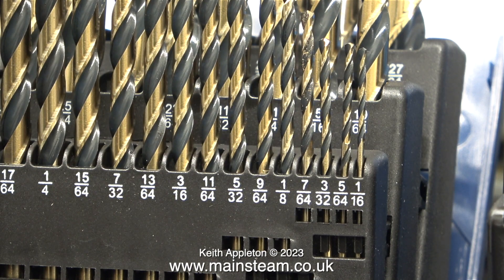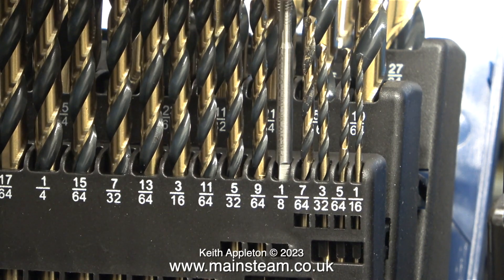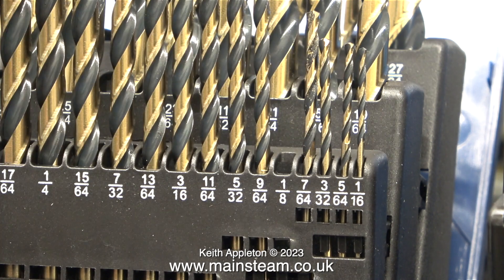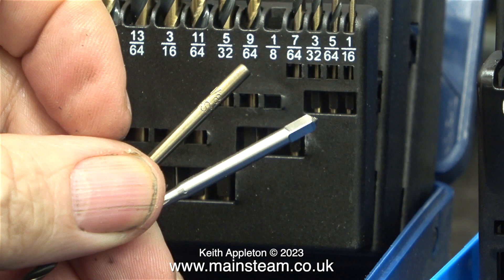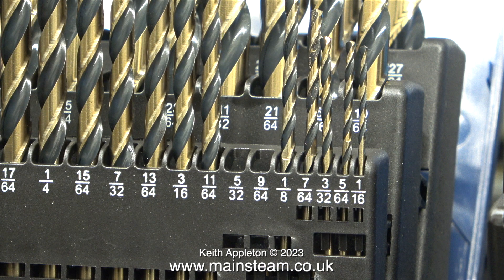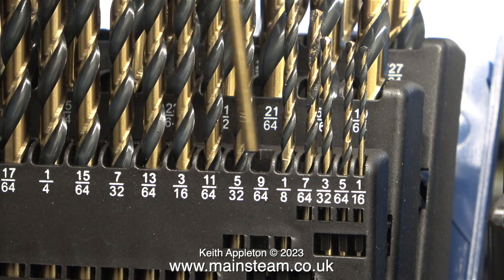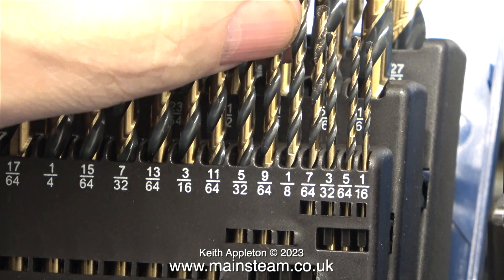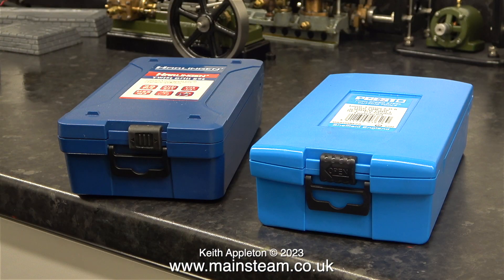I'd just like to mention that I only use the two imperial drill sizes down rule for ME or BA threads. For threads like BSP — British Standard Pipe — or Whitworth, which have very coarse threads, I would definitely have to look at a reference chart. But for things like this 4 BA tap, it's definitely one eighth of an inch diameter tapping size for me. I do like this twist drill set — you can actually see the sizes stamped heavily into the shank. These are high speed steel drill bits so they should last quite a long time. The clearance size for a 4 BA bolt is 9/64 of an inch, which is one imperial size above the tapping size, but sometimes for clearance size I would go to 5/32 of an inch — it's not always a good idea in some applications to make everything a perfect fit.